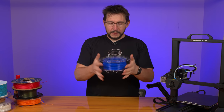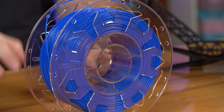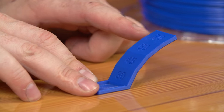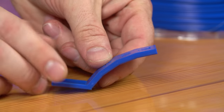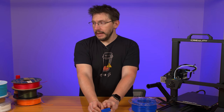The first prints were done with Creality PLA in a nice blue. One of the first things I printed was an overhang test that was on the SD card — numbers 30, 45, 60, and 70 relate to the angle — and it stuck to the bed just fine. Most notably, even at 70 degrees the underside looks pretty good. That is a good print.